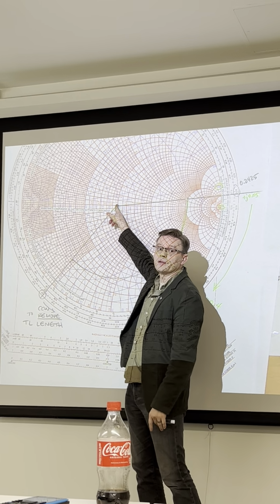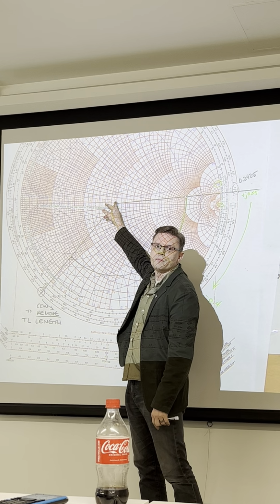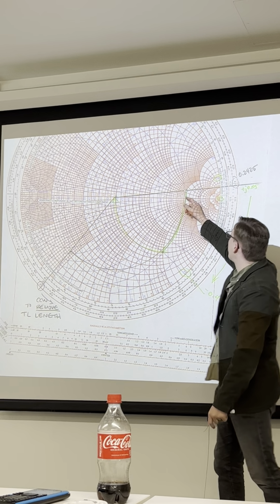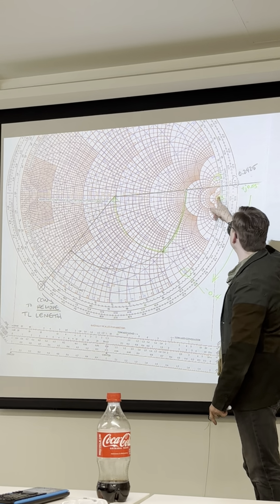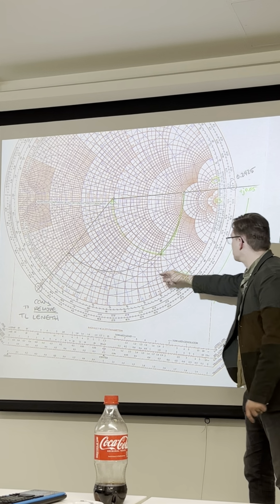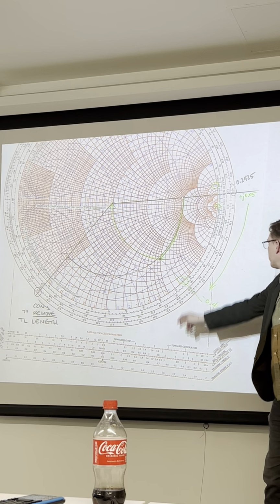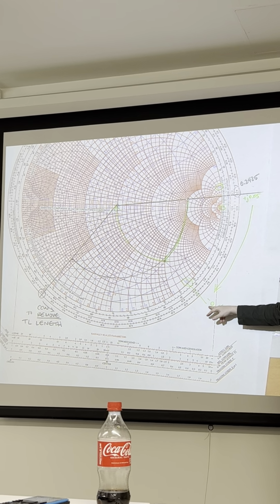What's the imaginary part of the impedance here? Zero. So if we went from a 2 to a 0, we had to have gone 2. That's the distance. Here we were along this line, and here's 1, here's 0.1, and here's 0. We said that's about in the middle, so we're going to call it 0.05, and we traveled down to this point on the blue line. And that was at 0.4, so that distance was 0.45. You see that?